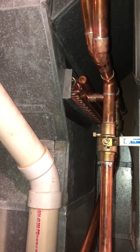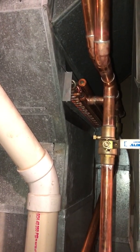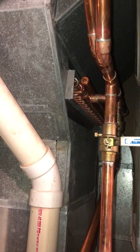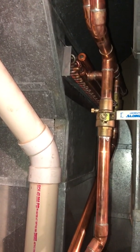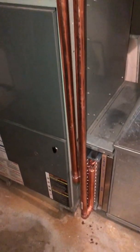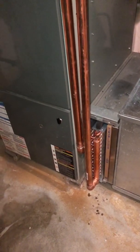Now I don't have anywhere near that. I think this furnace might flow about 1,200 CFM. I can achieve up to 7 gallons per minute of flow through that exchanger. And at times I will have 180 degree water, but to utilize storage and extend storage, you want things to work when those temps drop down. And if we can still heat the house with, say, 120 degree water, that's beneficial as we just extend storage, with longer times in between firings.